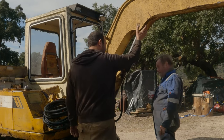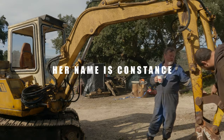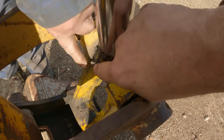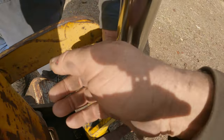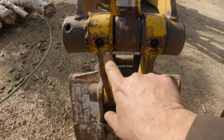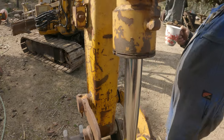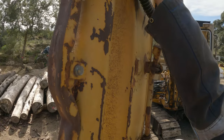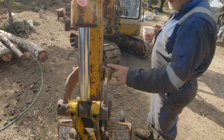Each cylinder will have a grease nipple at the top and one at the bottom. So how many nipples does this machine have? Count your cylinders. The first cylinder has a grease nipple there and one there — that's an angled type for easier access. Then there'll be another one at the end of the ram. So on that cylinder the grease nipple is in the end of the pin — every ram has one at either end. Beyond that you have the bucket linkage.